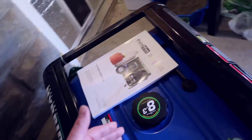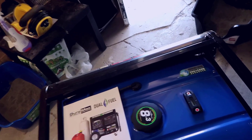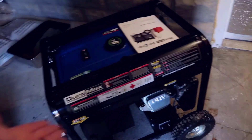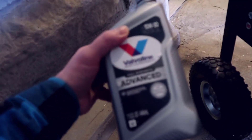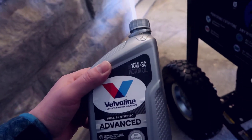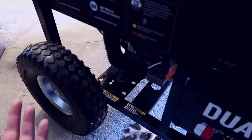On top you have a meter showing how full the gas tank is. This holds 8.3 gallons of gasoline — I filled it with about half a tank to start since I didn't want it sitting too long. Filling it is no different than a lawn mower. On the other side you can see the motor and the oil fill. It takes about a quart and a half — we used 10W30 as recommended in the manual. There's a dipstick to check the level, and they include a funnel so you don't spill.